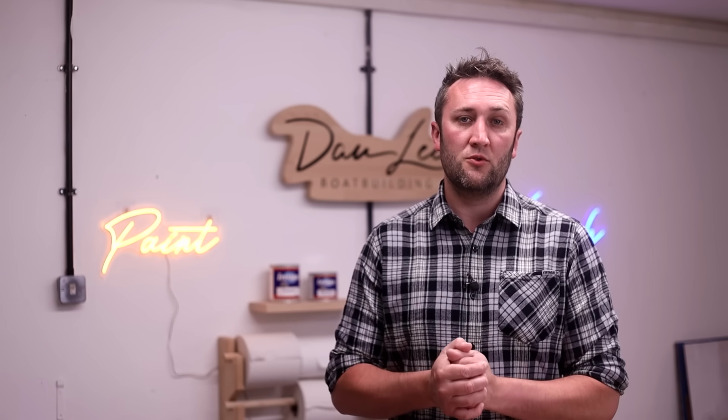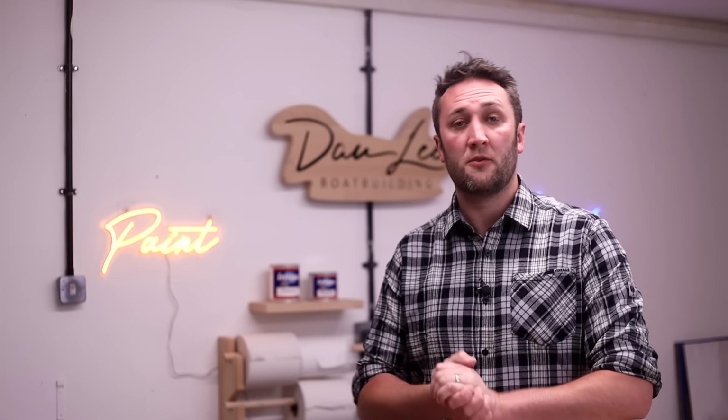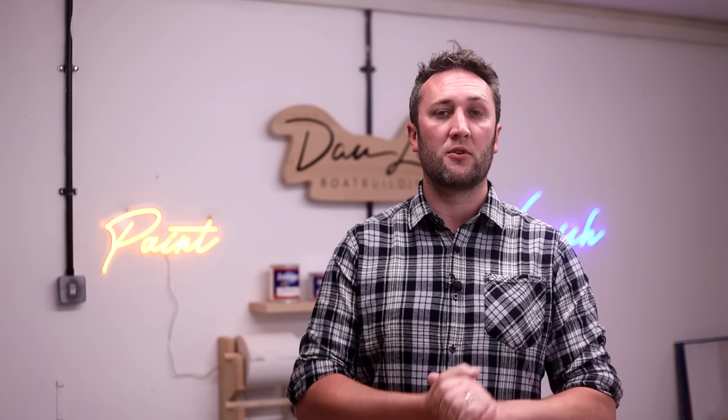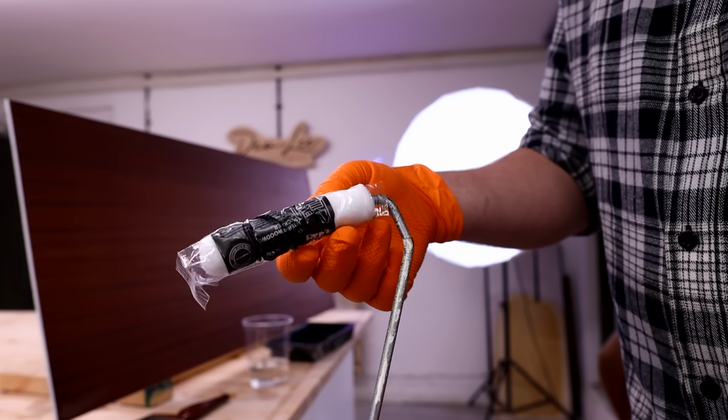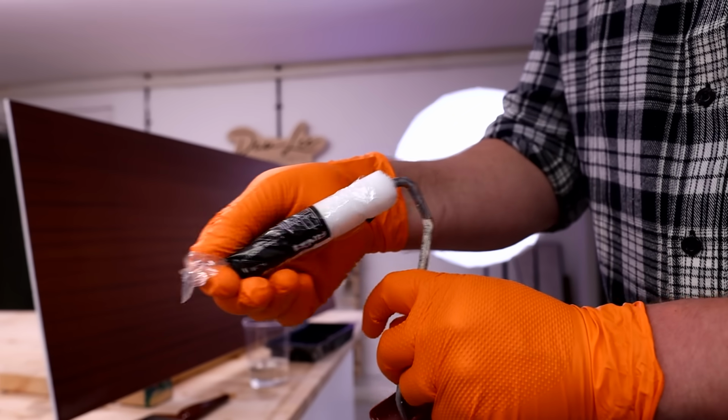Should you wish to use spray application for your finish, then take a look at the Epifanes Speed Coat product instead. And I've got a quick guide tutorial for that product on my channel. The Epifanes Multipren foam rollers are ideal for application of this paint, as are these Anza felt rollers, which are my personal preference, as they hold up really well against two-part products.